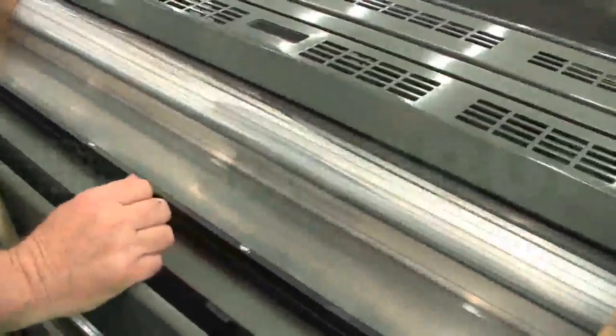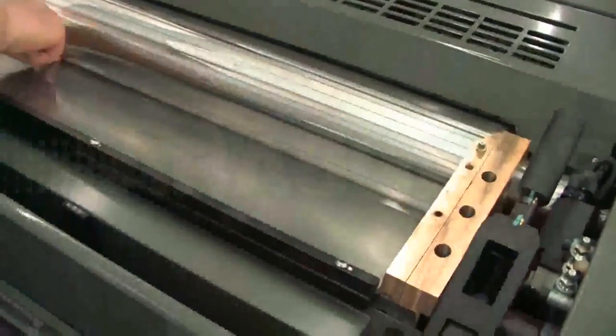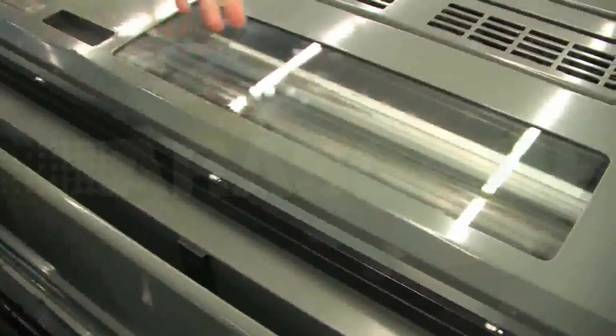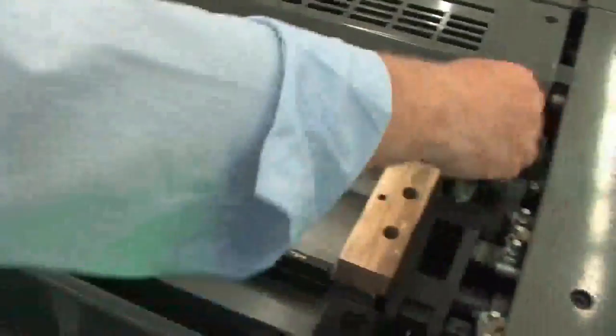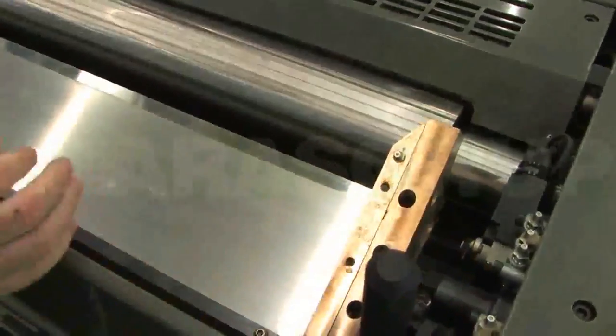So if it's left open like that for half an hour or so, the ink which is in here will start to cure on the edges. So we use this cover. We can see inside, but it's actually a UV cut glass. The ink fountain itself is part of the KHSAI system.